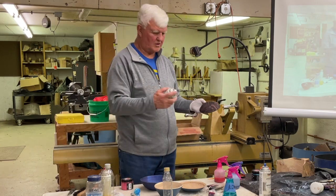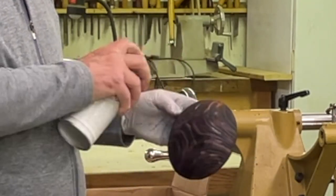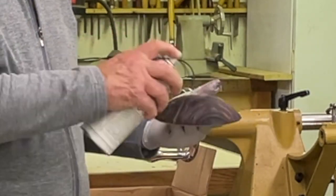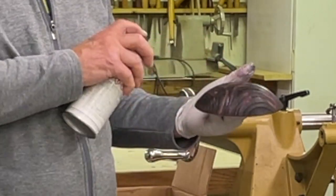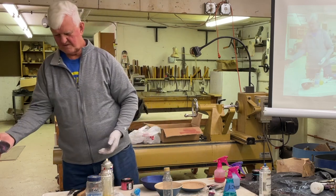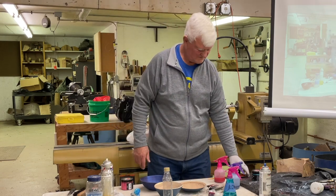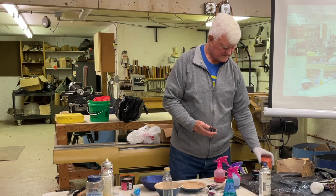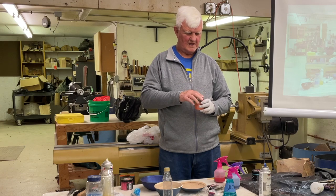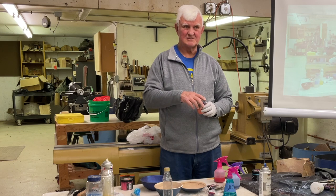It will take you about four coats of lacquer on here to get a very good finish. I use the electric spray guns — they're a little more beady, not as fine as a compressor. The low pressure, high volume ones you can use, but for this kind of work, these bottles work pretty well.